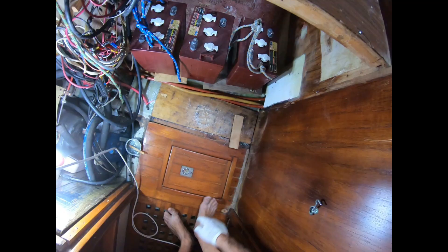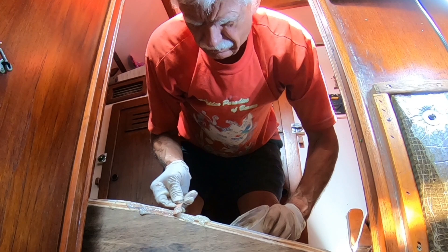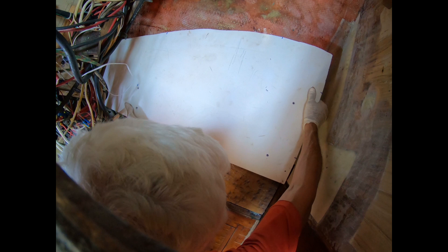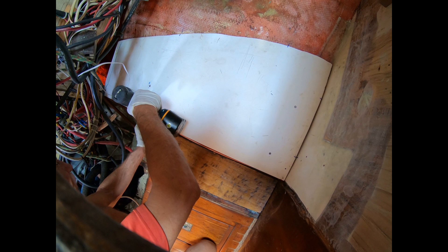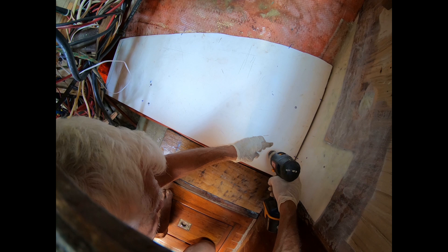Everything had been pre-fitted. Now it's time to lay down a heavy bead of thickened epoxy on those spacers and on the outside edge of this next floor panel. This is a big step towards completing this project, although there's still a long ways to go. You can see off to the right side an L-shaped piece of white panel on the wall — that was cut out of a bad area, glued in, and very securely fiberglassed along all the seams. These screws are just holding the panel in place temporarily until everything sets up so I can continue working on the left side, where there's another area of the wall that needs to be filled in.